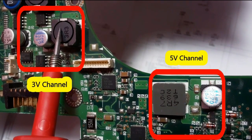This is the control IC, and around it you can see many components. I always focus on ceramic capacitors — they are among the very important components in every motherboard. Ceramic capacitors always help me to troubleshoot and isolate the failure. For example, if this IC is shorted, you cannot do a measurement directly on it easily like you would with a resistor, ceramic capacitor, diode, or zener diode — it's not easy.